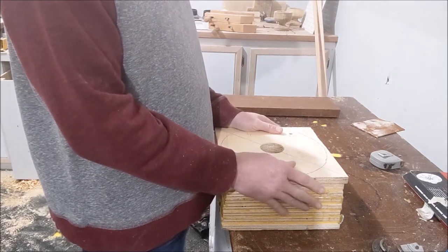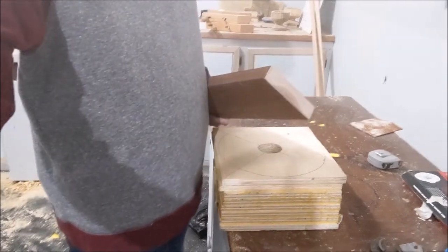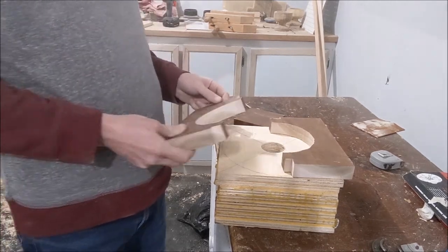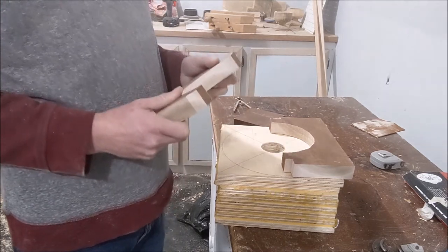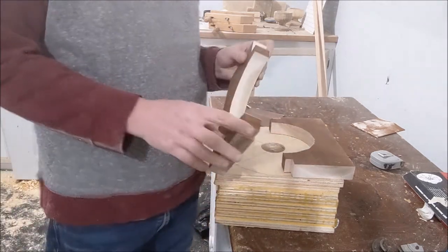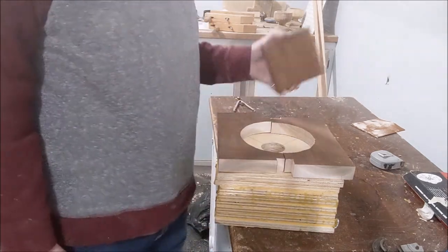Now I'll go ahead and prepare the rim and the bottom. I've gone ahead and cut this out on the bandsaw — no need to turn away all that wood. I'm doing this in two halves. The reason I cut it on the bandsaw is I'm going to take this over to my belt sander and smooth these two edges up, which are going to be the two glued surfaces. Rather than try to get a mating surface the whole length of the board, now I only have to get these two pieces squared to each other — much easier now that I've made them smaller. And this will be the piece for my bottom.